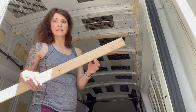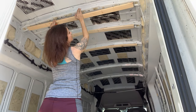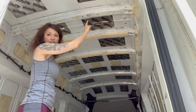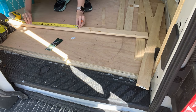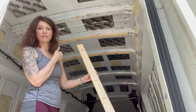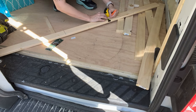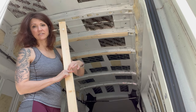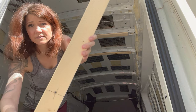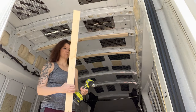What I'm basically doing is cutting my piece down and then holding it up in place and marking the center of each bolt. Once I make the marks I measure between the centers of the bolts and then measure between my two markings making sure it's exactly the same, then make a little line going down where that measurement is. I also want to make sure that my holes are completely in the center, so I'm measuring across and finding the exact halfway mark and making another line. So now I have these plus signs where I know to put the bolt — that part is working. Now I just have to figure out how to not ruin the wood.